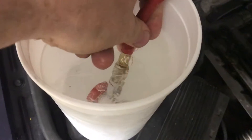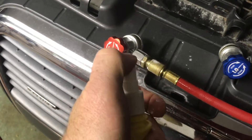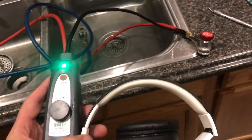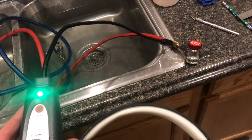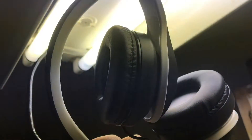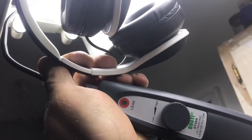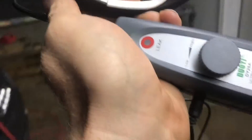As the air comes out of the leak, the liquid is going to enhance the sound. So I was disappointed that I know there's a leak here and it wouldn't work. It's certainly not going to give me much confidence to go in looking for a leak on an air conditioning system. Now I can pick up on electrical frequencies — here's a fluorescent light. I can definitely get some clicking going on here, especially when I get near the transformer. Sometimes when you tap the end, you can pick that up.